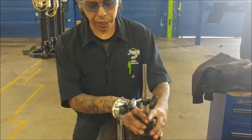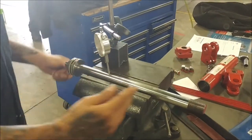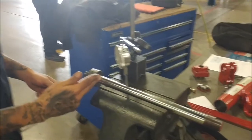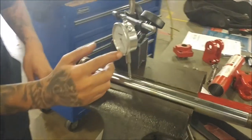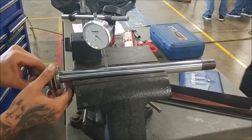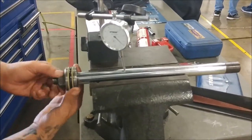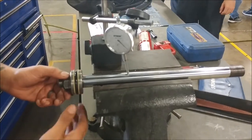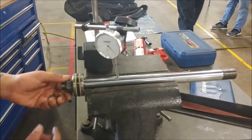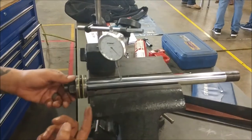You want to take four measurements all the way through - usually one on the outside, one semi-center, one right in the middle, and one closer to the end. We're just seeing how much the needle itself is going to move. As you can see, that's barely moving again, which is a good reading. We're going to go a little bit closer to the end. This is about where I'm limited, but as you can tell, it's not even moving right there.